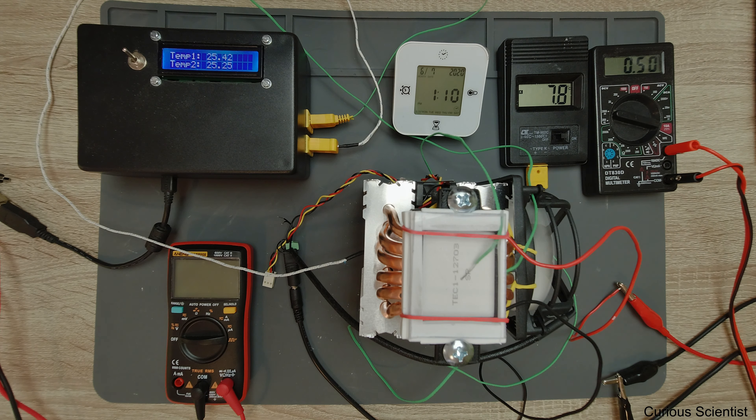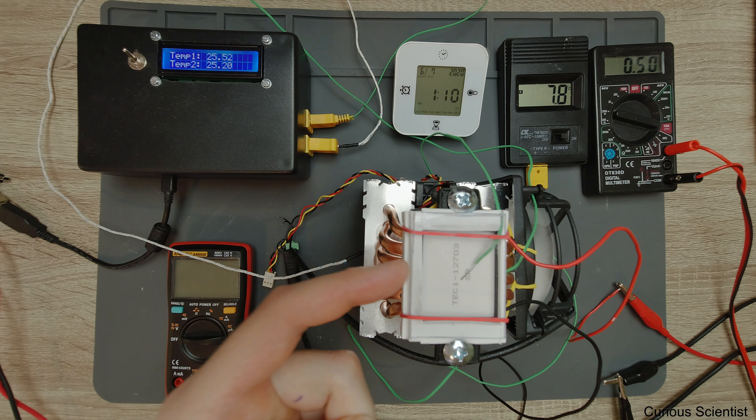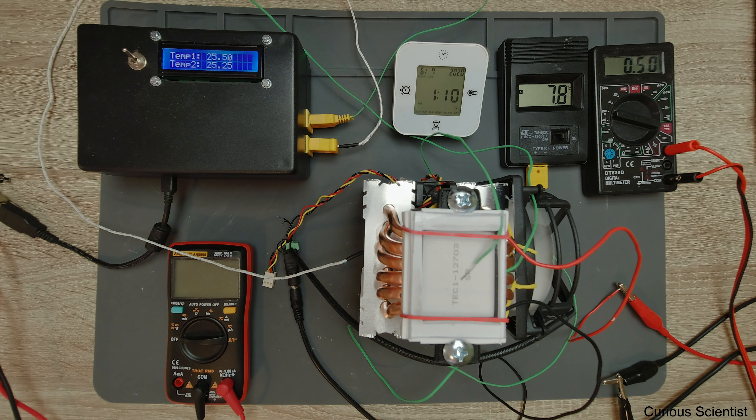After this study, I'll run this cooler with another cooler - instead of exposing the cold side to just this enclosed chamber, I'll place another cooler on top of the cold side of the Peltier cooler and measure the temperature there. Hopefully it fits, and we'll see how cool the air we can extract on the other side. I'll run this near 3 Amperes at maximum performance, measuring the outlet temperature of the fan to see if this works as an air conditioner.